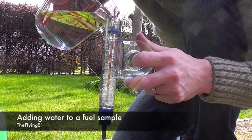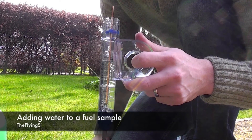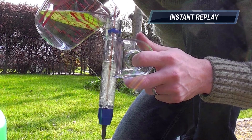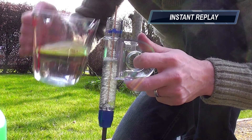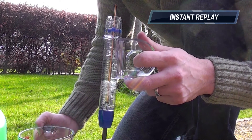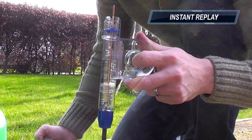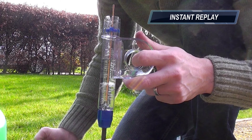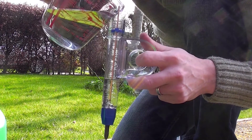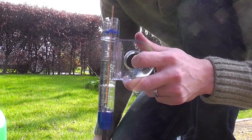Here's some water going in. You can see straight away they split — it's really quick. And here it is in slow motion: in goes the water, it bubbles up. A lot of people think that if there's water in the fuel it might take half an hour or so to get to the bottom of the tank, but look how quickly that water falls to the bottom of that fuel sample. The fuel is on the top, the water is on the bottom. Here we are again in real time — in it goes and done. That's a couple of seconds.